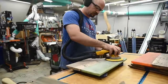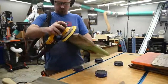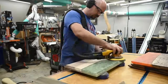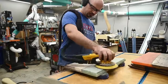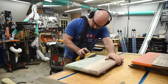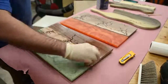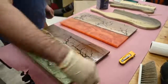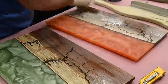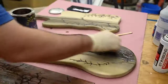Finally, the part I've really been looking forward to — sanding through the grits, which actually is kind of fun with my new Mirka setup. It goes faster, barely vibrates, is practically dustless, and is a lot quieter — I'm only wearing earmuffs so I don't have to turn up my earbuds as loud. For what seems to be everyone's favorite part, at least on par with pouring epoxy, is the finishing. To make sure these are safe for food contact, I'm coating them with General Finishes Salad Bowl Finish, which is non-toxic when cured.